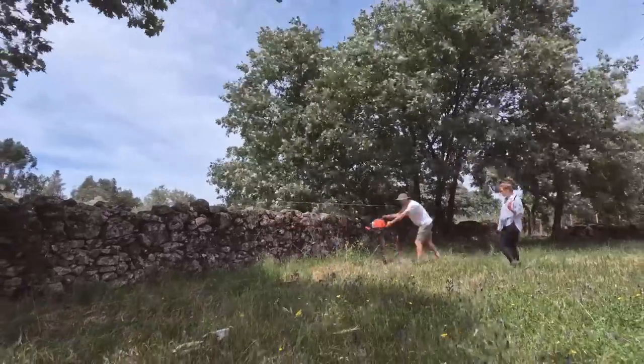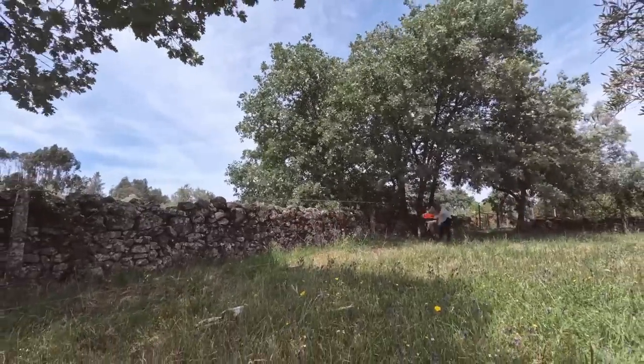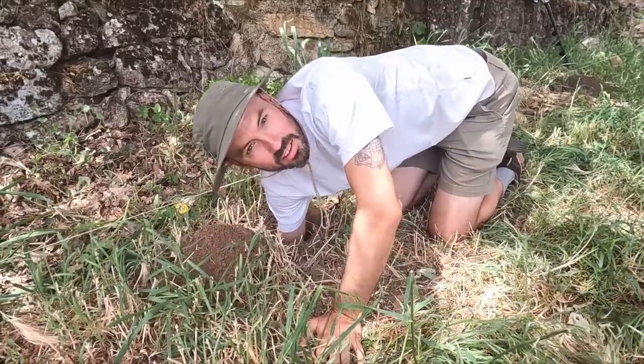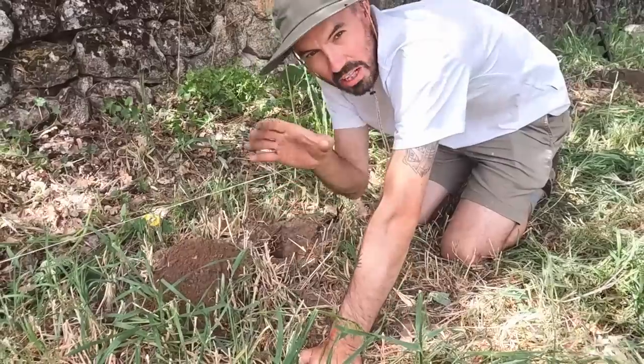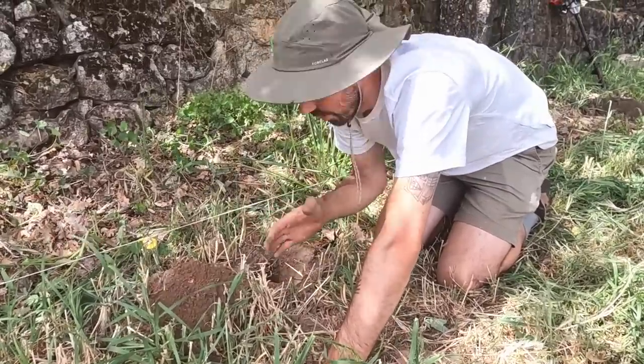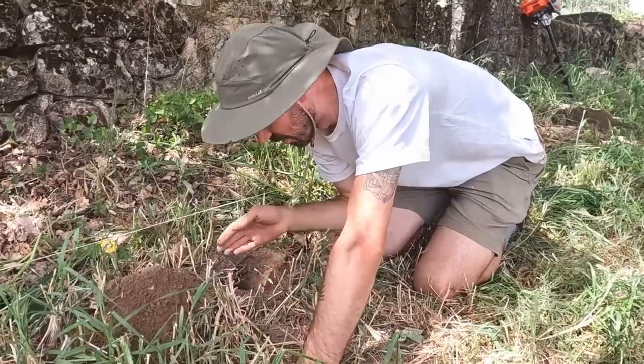After that, we've whisked through and done another eight or so holes, no problem at all - pretty much smooth sailing. However, with that post digger we're using, we're using a thinner drill bit. Before we were using a big fat one which was taking out a lot more earth than we needed to, so we've dropped it down to a thinner one, and I think that's a better choice.